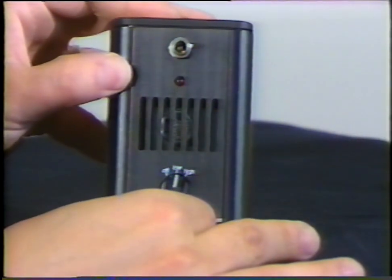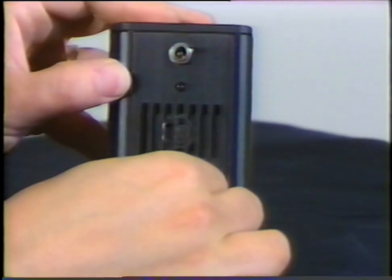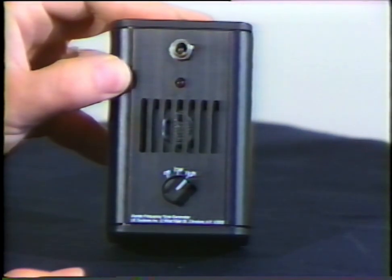Turn the tone generator on by selecting either low for low amplitude signal or high for high amplitude. This flickering red lamp indicates the tone generator is on. A smooth, continuous, warbly sound should be heard. If a beeping is heard instead, then a full recharge of the tone generator is needed. For more information, refer to the instruction manual.